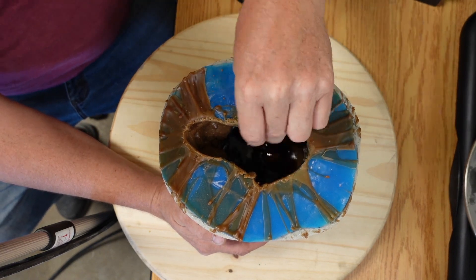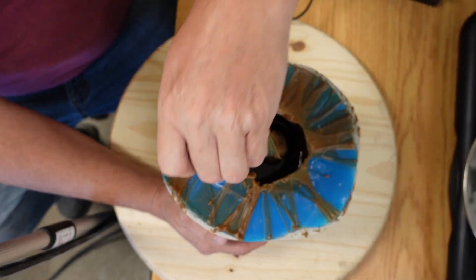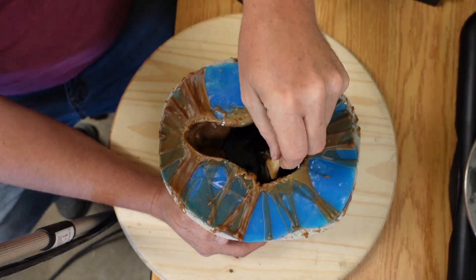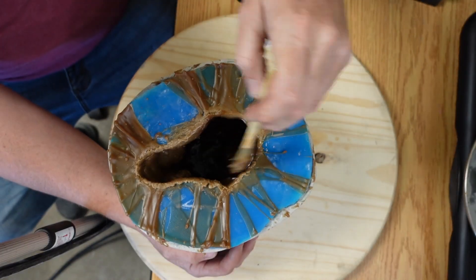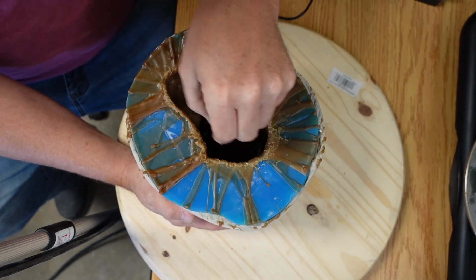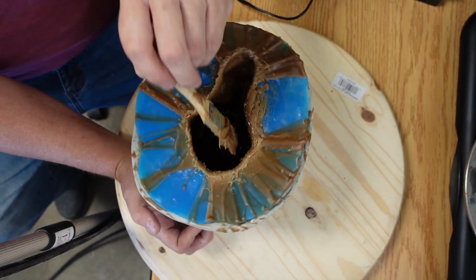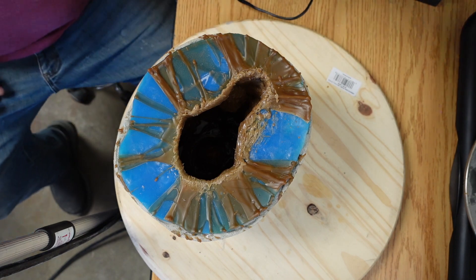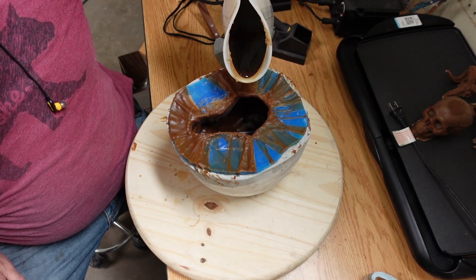Here I'm brushing in the wax. This is a good way to build up layers quickly and it works really well. If you have access to the inside of the mold, this is a quick way of building your layers. With this doorstop I wanted it to be really heavy, so I actually built it up — I think it ended up being like three-eighths, almost half inch thick of wax, so it was really thick.